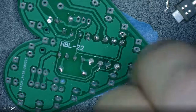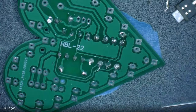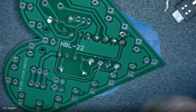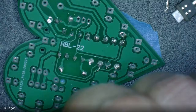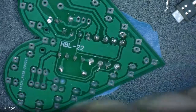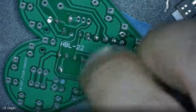And then as far as tinning, when you feel like you're not getting heat transferring to the pin is when you want to tin it. So you don't need to tin it every time, but that's when you tin it. It'll generally have solder left on it between the others. But if you let it sit there for a while, and it's sitting there hot, it's also going to oxidize. So that's when you clean it. If there's been a little while between when you've moved solder on it, you would clean it, and you would clean it periodically, maybe every three or so times. Just dip it in the flux. There might be some harder rules about this, but I'm sharing my experience, and that's what I've done.